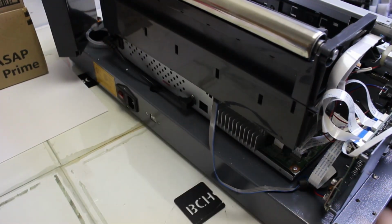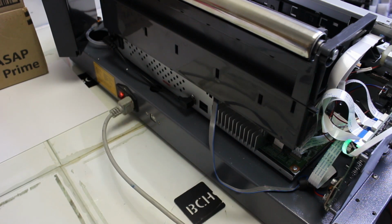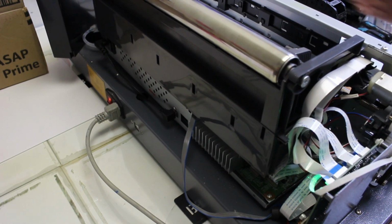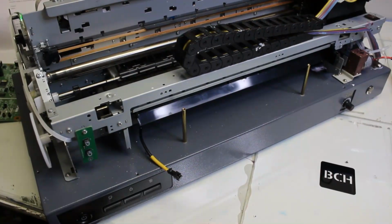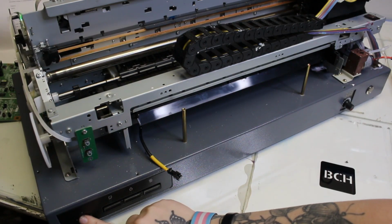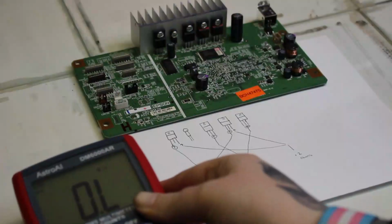Go ahead and plug in the back cables, power it on in the back, and turn it around to the front, and we'll try to power it on. When I put in the customer's mainboard and powered it on, we couldn't power it on. So for me, that tells me that it's still the MOSFET transistors that are messing up their mainboard.